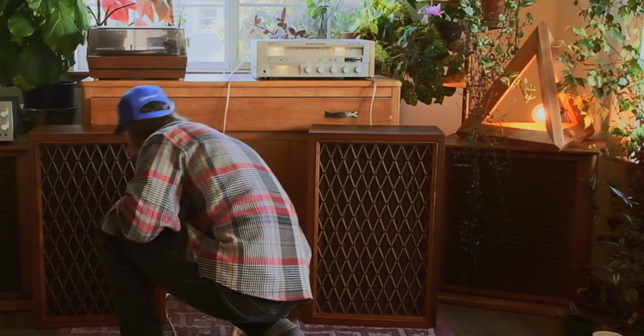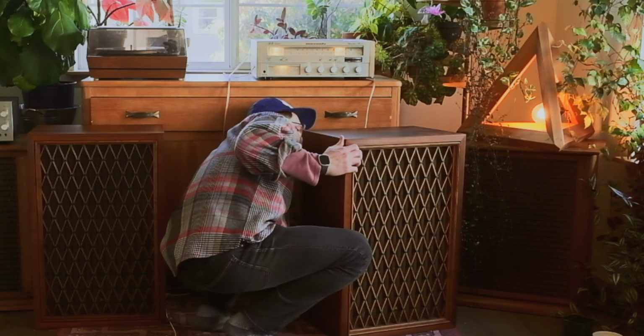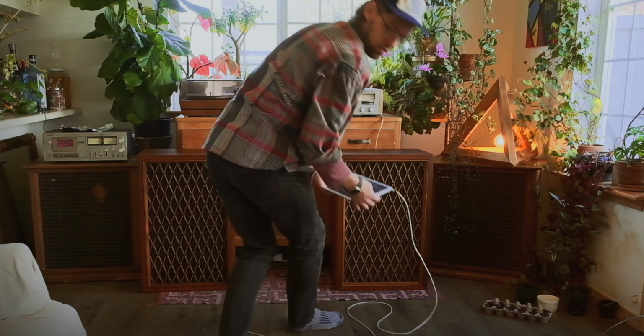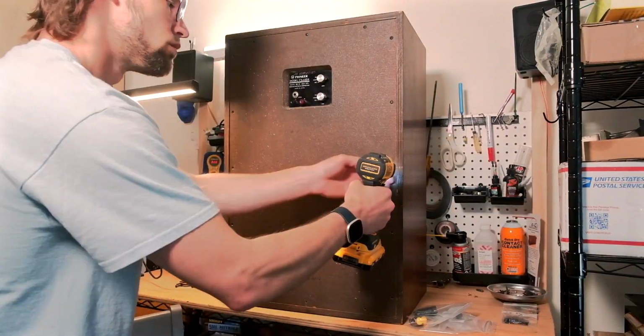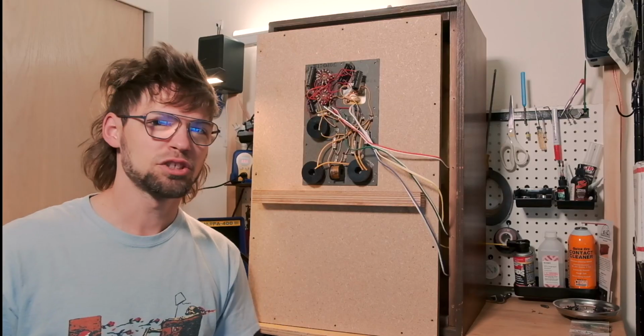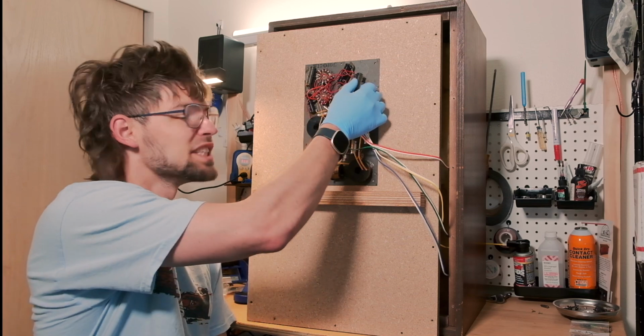Increasing the mid and high levels with the knobs on the back did help brighten them up, but didn't fix them entirely. As far as the bass response, the Tannoys definitely go lower and have more bass energy under 45 Hz. What I'm hoping is that when we recap them, the normal function is going to sound about the same as the increased function. I placed an order for the new capacitors, but one of them was sent to back order, so it's a few weeks later and I've got all the components here. I also put a parts list for the crossover in the description, complete with most of the resistor values.